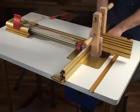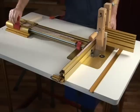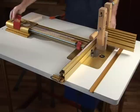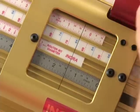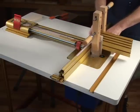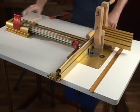Beginning with the scoring pass, advance to the first template mark in front of the zero in one or two passes. Once you've reached the first mark, 6A in this example, and made the cut, simply move the LS positioner from one A cut to the next until you've cut across the full width of your stock.